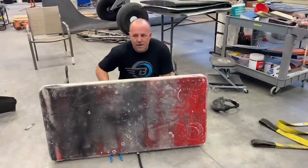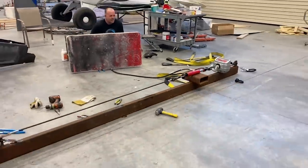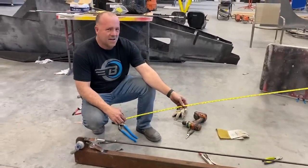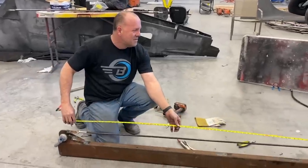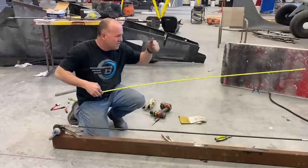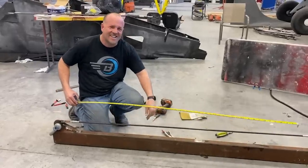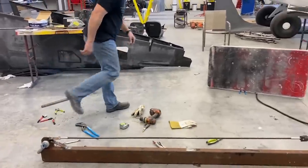All right, guys, carbon fiber pull test, coming up. Look at that here. 658 pounds. I didn't mean to go right to 600 pounds because that's actually within limit to fly the aircraft. But there's no rope that's stretching as I pull. So as soon as I move it, it instantly pulls all the force on it. So that's already tighter than you put it on an aircraft. So 69 inches exactly still. Let's keep going.